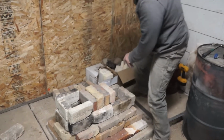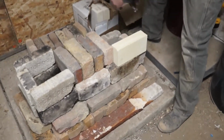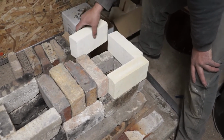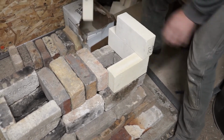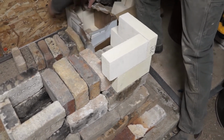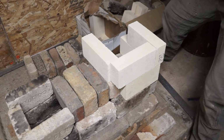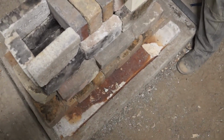The heat riser is back here, and we're going to use this insulated brick for the heat riser. We'll stack up the swirling pattern like this. This first brick will get cut to fit in there. But then from then on, it's going to stack. We're going to just keep that swirling pattern going. That'll be a nice heat riser too. Yeah, it's going to be a really nice looking riser. Big, fresh, brand new, clean bricks right out of the box. Absolutely. Now, we could have built everything from here back out of this stuff.